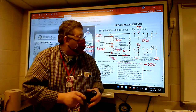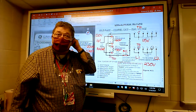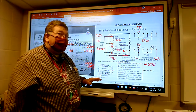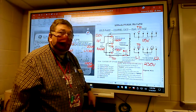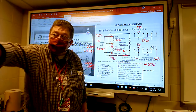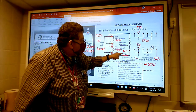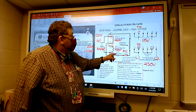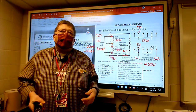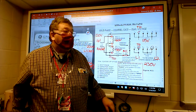If you listen when you cut that thing off and hear it slow down, you'll distinctly hear a click at the point where that switch recloses - it's a heavy spring mechanism and it's a definite click you can hear. Problems you can run into: most of the time it's the capacitor that's out - that's what happens most often in heat and air systems. The centrifugal switch can also be bad, but not very often. To test it, take the capacitor out, disconnect from power, and put an ohmmeter from here to the T8 lead. Check continuity through the winding - if you get OL on the meter the switch is no good; if you get a low resistance reading the switch is fine.